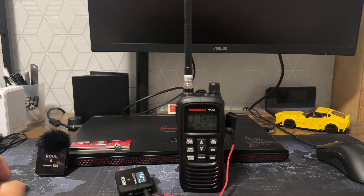The next thing you do is press the VOX button — when it is on, it's pretty self-explanatory. Turn that on. Now when we start talking the radio is not that sensitive by default, but when we just talk it is going to start transmitting automatically without having to press the push-to-talk button.